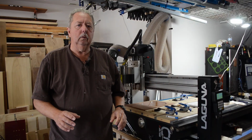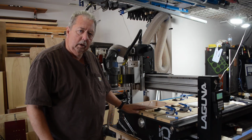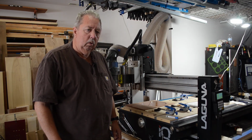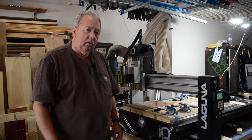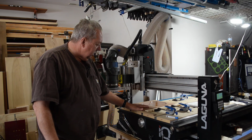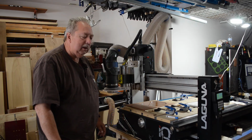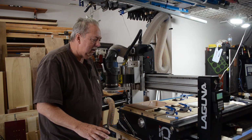We're at a point in the video where we've put the clear coat into the wood, and our next step is to actually carve the black layer, which will be the background that we carve the white into. So we're at the point where we're getting ready to do that, and we'll start setting up the machine and making that carve here. So the first thing we need to do as we set up this carve is we've replaced the board in the machine with the XY and everything in place. I did a real quick check off camera to make sure my XY hasn't changed. I didn't adjust it, and I wouldn't adjust it, but I just wanted to make sure there isn't something that happened that doesn't make sense.